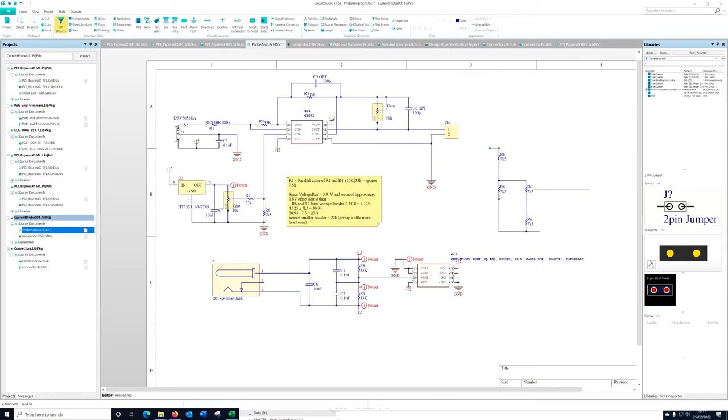On the right-hand side, the top resistor represents the trimmer and the bottom resistor represents a little offset, so we're limiting the range the trimmer covers - not the full 3.3 volts, just sort of 0 to 0.8 volts or something like that. That seems okay because the impedance in parallel with the Zener is constant - but it's not, because it changes thermally, and the trimmer has a very different temperature coefficient than the fixed resistors around it.